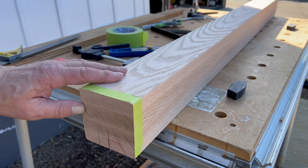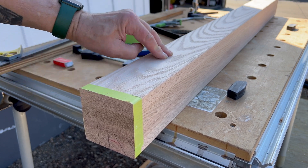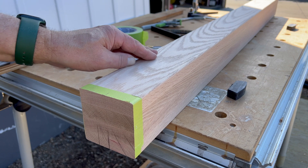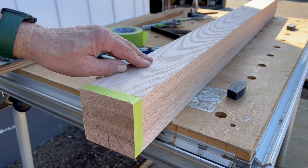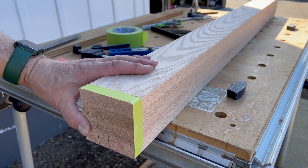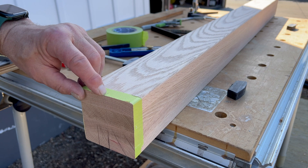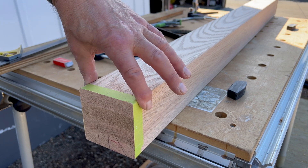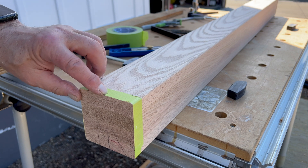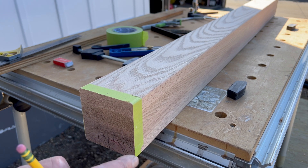This is the face of my post that's going to be on the left side of the staircase as I'm looking at the bottom — the nicest grain pattern — and I'm going to have that facing as you go up the stairs. I've determined the center of the post here; the post is three and seven-sixteenths wide. I've marked down here so I can make a mental note of what portion of this post I want to notch out, because that can be confusing.